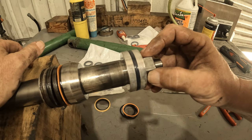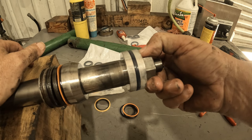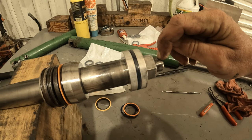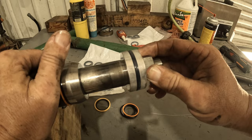Before I even try to do anything with them, I just put a little heat on them. The only reason I'm putting the heat on is mainly because of the Loctite - you get that stuff warm and it becomes a little more viscous. It'll still be snug or real tight, but you can get it off without damaging these threads. These threads are really fine and they're easy to roll over. So just by warming it up gives me that much better of a chance to get this nut off without jacking up these threads.